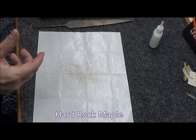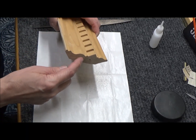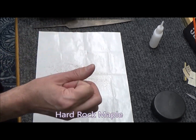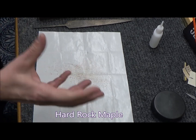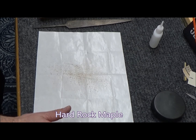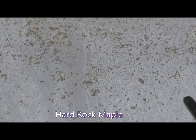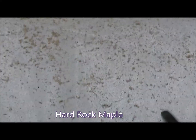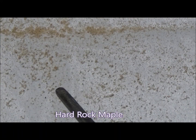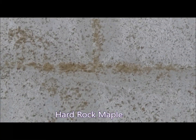I've got a fine rasp and I'm going to run it down the edge of a maple board to produce fibers. This is different from maple sawdust — if you were doing fine grain filling you'd belt-sand the end grain of some maple and get really granular, pebble-shaped, spherical dust. These don't have that shape. These are more like jelly-bean shaped, elongated like grains of rice. That's the shape of fiber you want.